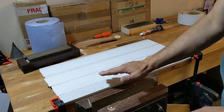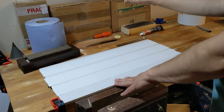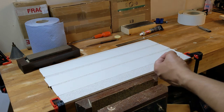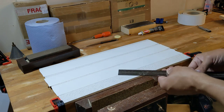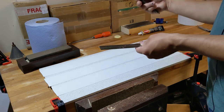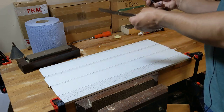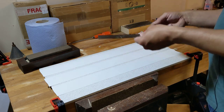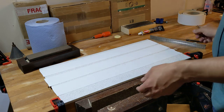So, it seemed to me that buying an expensive granite reference plate for working with relatively cheap tools was not going to be the best way to go about it. So what I did was I went into a local tile supply shop with my Starrett ruler, which belongs to my combination square, and a feeler gauge, which matches the modern tolerances that planes are made to. Now, I believe that's about 1.5 thousandths of an inch, and I think that equates to about 0.04 of a millimetre.